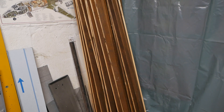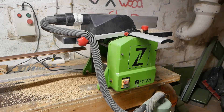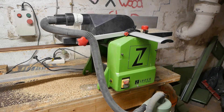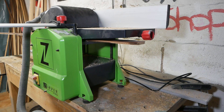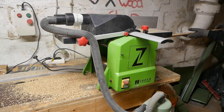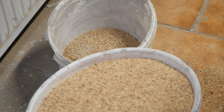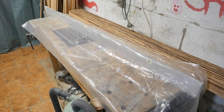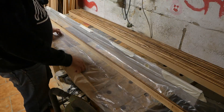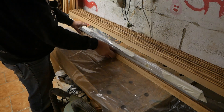So that's all the tongues which I cut off, leaving this pile of good wood. Next up, they all go through the thicknesser — so that's a bit nicer. How do you home wood shop guys get rid of all the sawdust? I mean, I've already made a bucket and a half and I've only just started. These strips are very flexible, so when I laminate them to prevent a big curve, I'll try clamping them between two straight edges. Straight edges are also somewhat flexible, but let's see if it helps a bit.